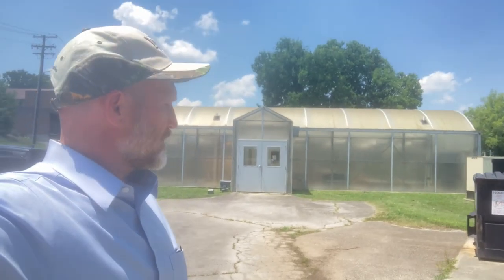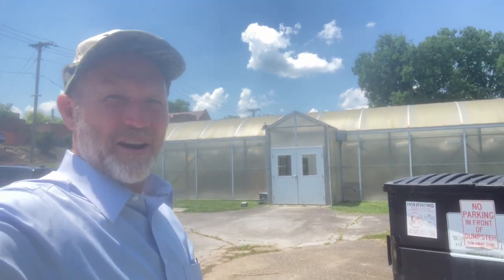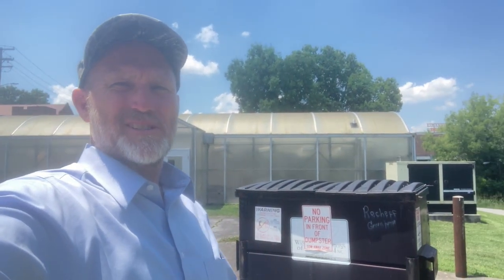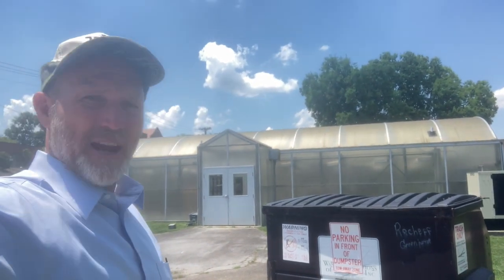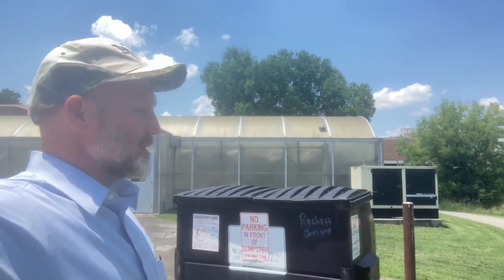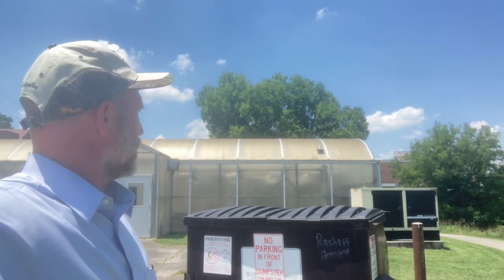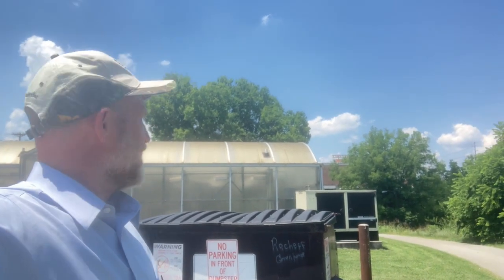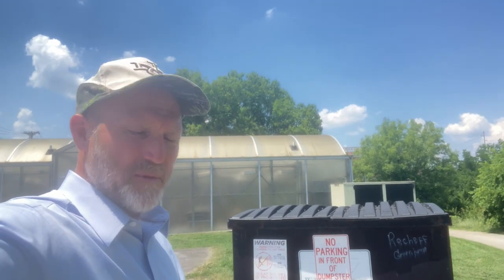So this is exclusively a polycarbonate structure. It's about 6,000 square feet thereabouts. The nursery manager wasn't sure, but she felt it was around 20 years, if not more. And there is definitely some yellowing you can see. What's interesting too is the lower elevation here in Tennessee compared to the Intermountain West. I think it enables a slower yellowing process. So if this is 20 or 30 years old, there's not as much yellowing as you'd expect. That's why I don't think that this is 30 years old.